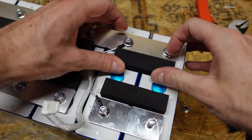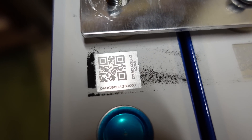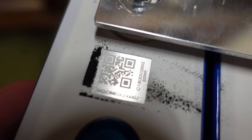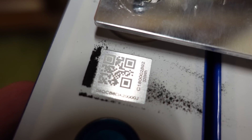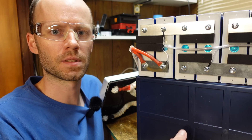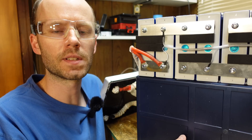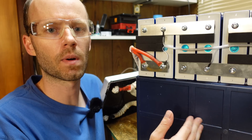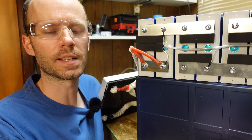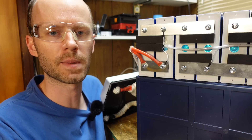Let's see if we can locate one of the QR codes here. Based on the beginning being 04Q, I'm fairly certain these are EVE cells — 320 watt hours, which is a 100 amp hour cell. Several months ago this battery was reviewed by another YouTuber, Mr. Prowse, and there was soldering of conductors and lugs inside. The company very quickly said they'd look into it and improve it — and that's what I love to see, a company that listens to customer feedback.